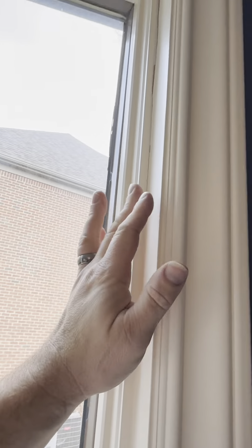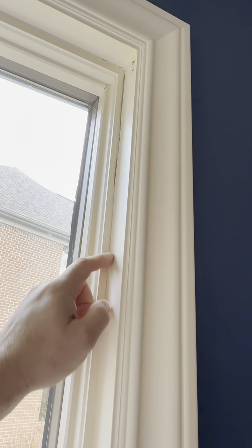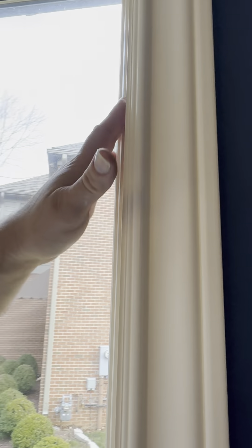Now we're moving on to the trim. We've got everything sanded. We just need to do a little bit of caulking before we get into the paint. We've got some expansion and contraction — the corner here is cracked out. So we're going to put some caulk in there so it gets a nice smooth finish when we're done with the paint.